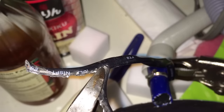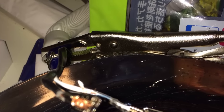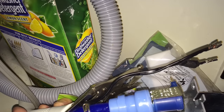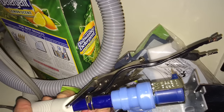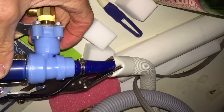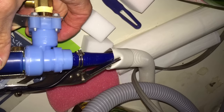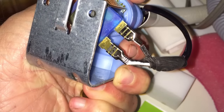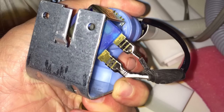Use your diagonal pliers to split the black power wire into its two sides. Strip back about a quarter inch of wire from each side, then use your spade connectors and crimp them on using a pair of pliers, so each of the black wires has a spade connector. Slip the blue hose all the way up onto the water valve, pushing it as far up as you can. Grab the hose clamp with pliers and pull it back over the blue hose all the way up toward the valve. Now slip the power connectors onto the terminals, make sure they're snug, and cover them with electrical tape.